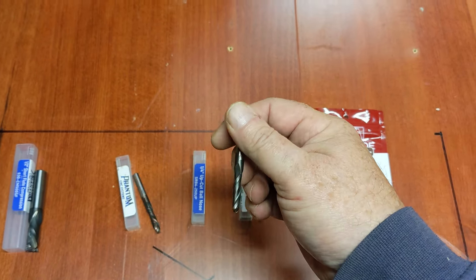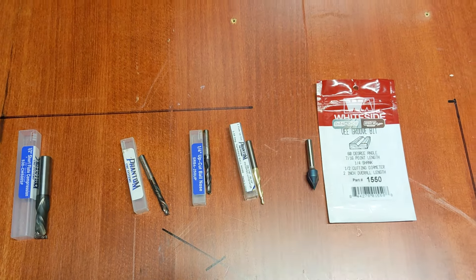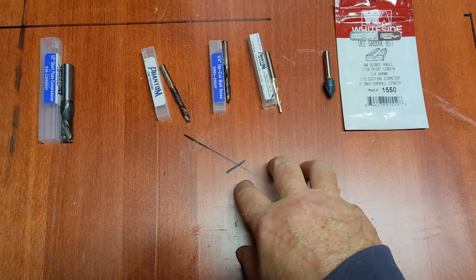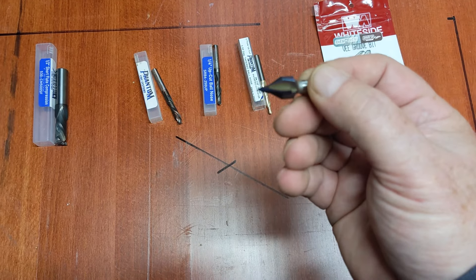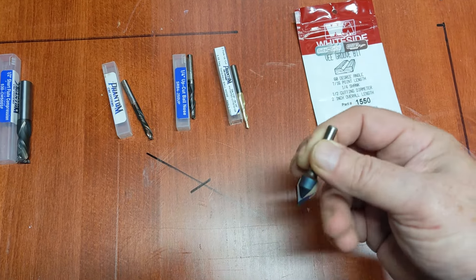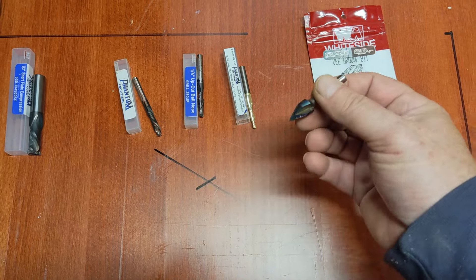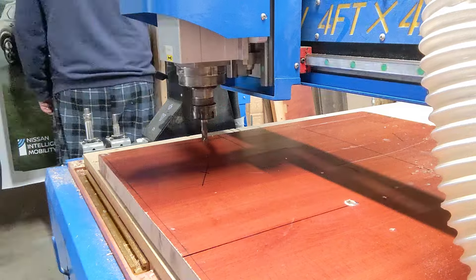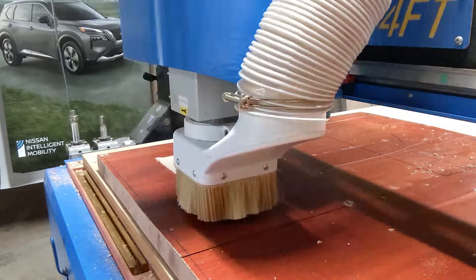Then I'll come through and cut out the back of the bowl, and do a tapered edge using my quarter inch ball nose. For the detail I'll use an eighth inch tapered bit. For carving the ornamentation - this will be a gift - I'll use my wide 60-degree V bit. It's got a nice wide half inch cutting diameter so I can do some pretty good detail. Even at shallow sizes it opens things up and looks really nice.